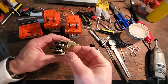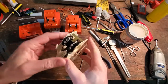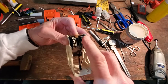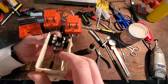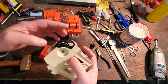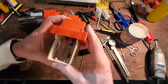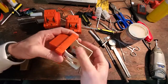Now you have this brass piece, and that's going to slip into those little teeth right there, and it rests there. You can do a test by keeping a finger there and holding it together. It's not springing back like it should — there we go. Let's see how this whole thing pans out. Go ahead and put the top on — you want to put the front fingers on first, make sure this doesn't get jammed. Insert it inside like so, put those in, and then the back teeth. It pops into place.